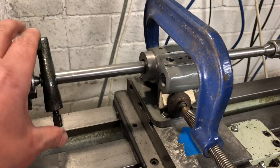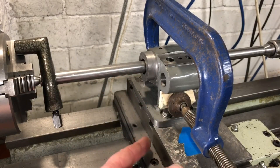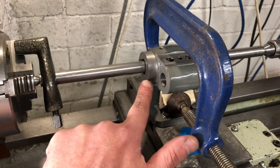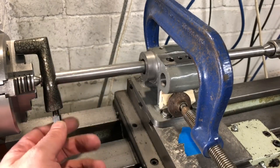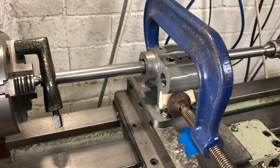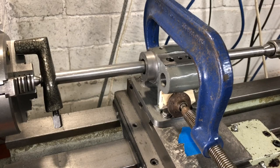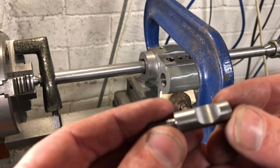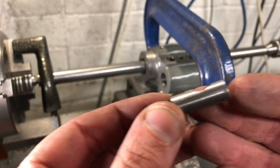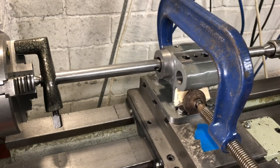I have removed the boring head and here we are set up with the between-centres boring bar. The casting hasn't changed position on the cross slide, and the cross slide hasn't changed position either, so the bore we are about to create should be concentric to the collar we have just machined. The bar is being driven by a dog up against the chuck jaws, and it is being supported between centres — one in the chuck, which I machined in situ, and one in the tailstock. The clamp here is holding in the brass cotter, which is in the hole on the other side of the casting, and that will be machined with the bore in exactly the same way as the two tailstock cotters, getting this scallop feature machined into it, and it will then clamp the main spindle when tightened. I will be feeding this towards the chuck under power, so the only thing left to do is to touch off, put on some depth of cut, and get started.